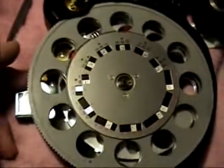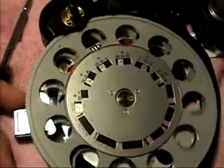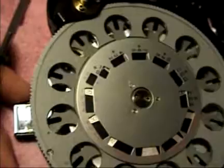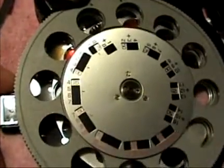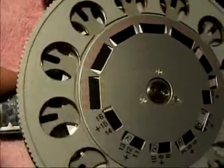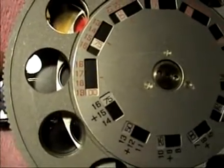With the power wheels reassembled, you can see as it advances it clicks both wheels simultaneously, which is actually the 1.0 of minus and the 1.25 of minus. The same process continues, again combining the lenses in quarter unit increments until it gets all the way to the end. When it reaches 19.0 of minus, the next click takes it to 16.75 of plus, switching into the opposite extreme of farsightedness, but it keeps going continuously like this until you eventually get back to zero.